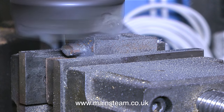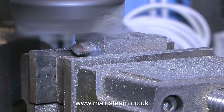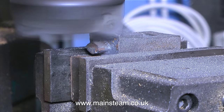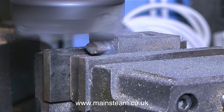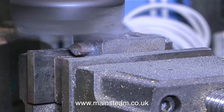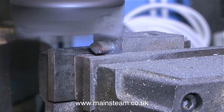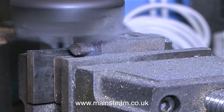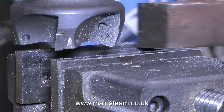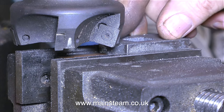So this casting that I'm currently machining — I'm using a face cutter, which is a large milling cutter with lots of teeth. All of the teeth on this cutter are replaceable carbide-tipped type, but they do need replacing; they've been on here a long time. That's why, if you notice, I'm cutting using the inside edge of the teeth, not the outside edge. It makes a real racket when I go in with the outside edge because they're not terribly sharp. When I stop the cutter to position the piece for the next cut, you can see the damage to the tips of the teeth.